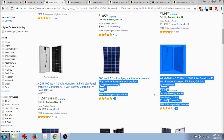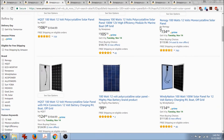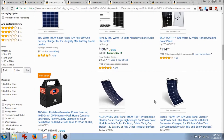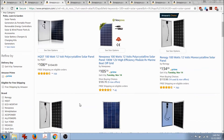You want to make sure it's UL rated. I've actually bought Windy Nation panels before — a couple in my DIY solar setup. The price went up a little, but honestly just get something cheap here. A lot of these are private-labeled panels — they could be the exact same panel with a different name. Stay away from flexible panels because they're super expensive at $150 plus, throwing off your system economics. You really want to be paying a dollar to a dollar ten per watt.